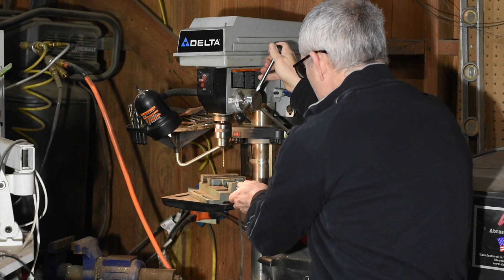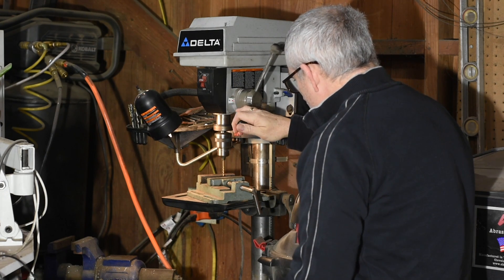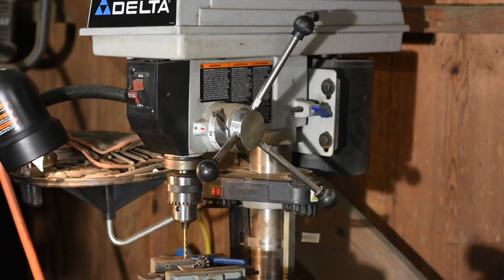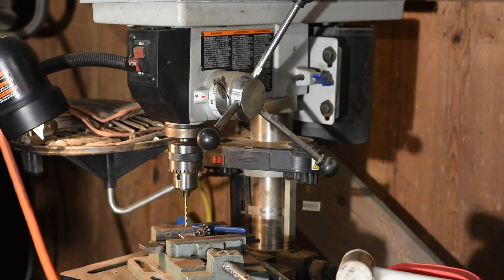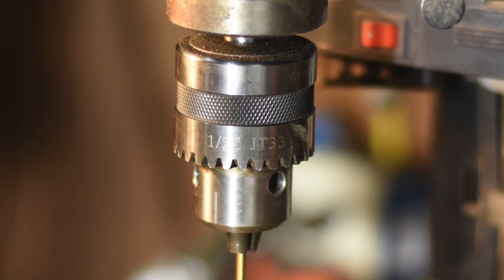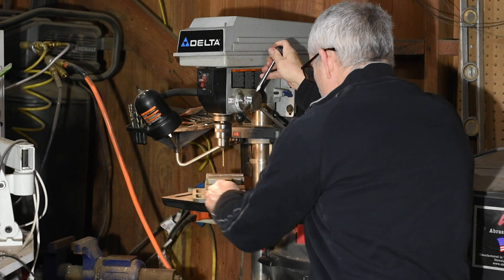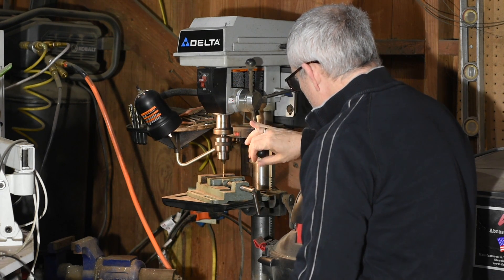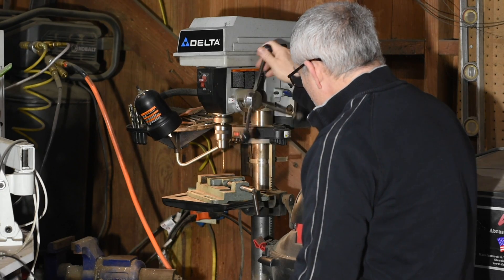Use a drill press. This may seem a little obvious to most people, but the single biggest thing you can do to improve your hole drilling is to use a drill press. Even the cheapest piece of Harbor Freight garbage is a quantum improvement over a hand drill. The sweet spot for starter drills is in the $200 range, where you'll get a decent consumer-level benchtop model with a half-inch chuck and somewhere in the third to half horsepower motor, or a used floor-stand model from a solid brand like Craftsman or Jet. Those will be a little bigger and have better horsepower and rigidity.